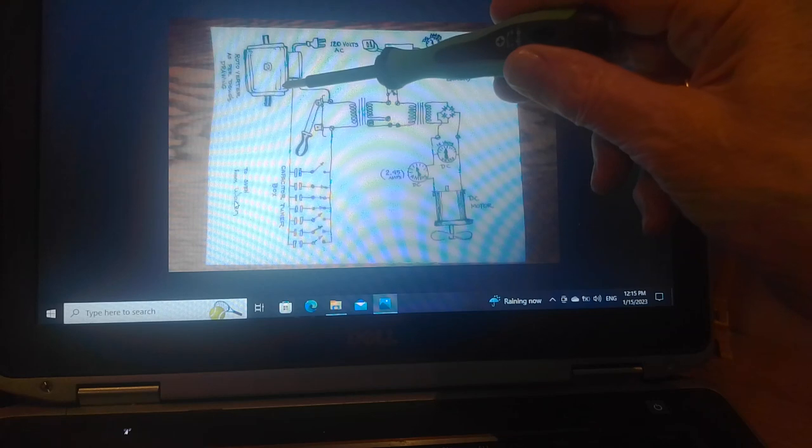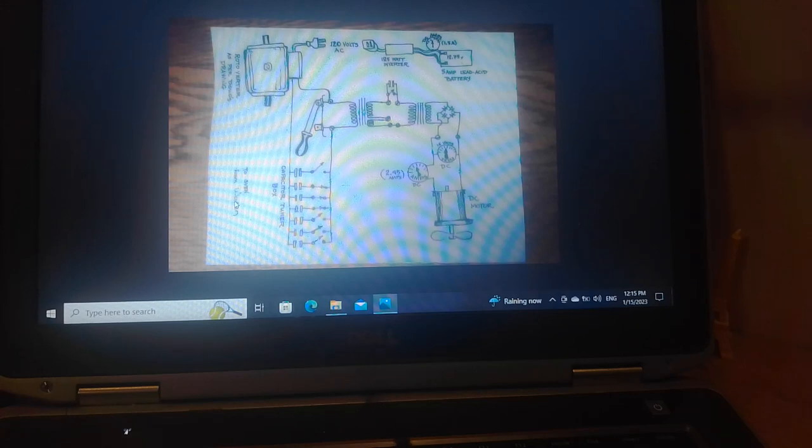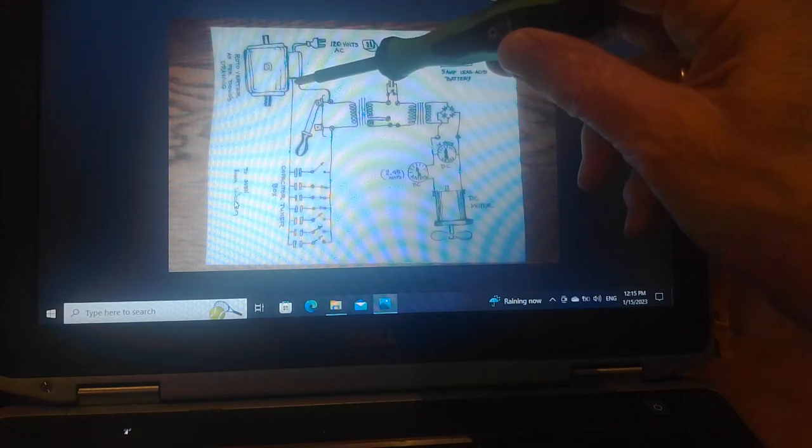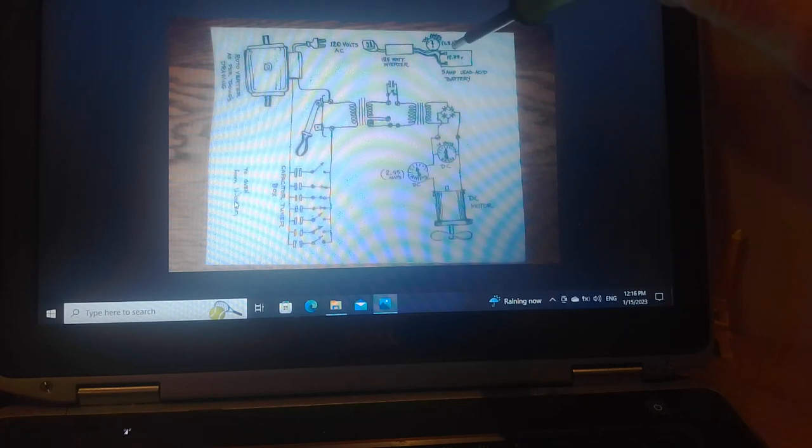He used a, I believe, 3 horsepower size, WEG brand, made in China. And he ran it on a 125 watt inverter he had that was really a nice little efficient one. Just running on square waves, it's not pure sine wave. Rotoverters don't need pure sine wave to run good. And he powered it with a 12.75 volt DC battery that was putting out 1.5 amps. So this is the input in DC.